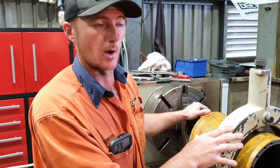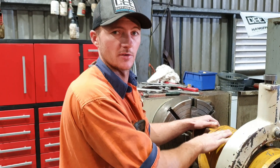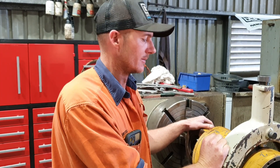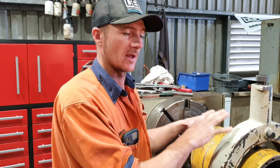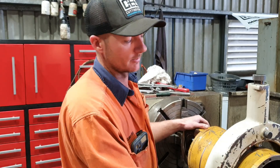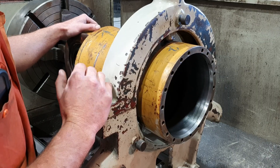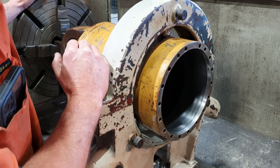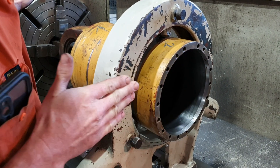The issue I have at the moment is the outside's running pretty good, considering it is a painted surface with a bit of damage on it. But I'm saying the inside's probably out by a mile. Being the inside's out, when they tighten the gland and the rod into the barrel, everything locks up. That tells me the thickness of the tube all the way around it might be different from one end to the other. So what we've got to do now, we're going to dial in the other end of the barrel using the forejaw, get that running nice and true, and then we'll see how much runout we have here on the face and machine the face true.